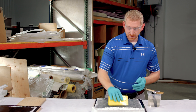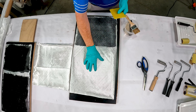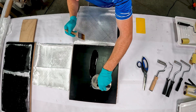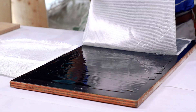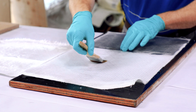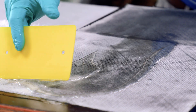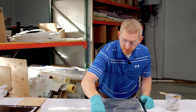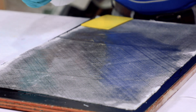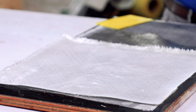Now with multiple layers of glass, I'll do the same approach and incorporate more layers to show how to go about it. Pour a nice even coat on the surface and even it out with the brush, running it at a slight angle to make sure the glass makes good contact. Pour more epoxy on the surface, then switch to the flexible plastic spreader at a low angle — same as before. Gradually build it up but fully saturate the cloth. Squeegee off the excess, then come back and squeegee a thin even coat to keep it wet for the next layer. Now we have another layer of glass to put on the surface.